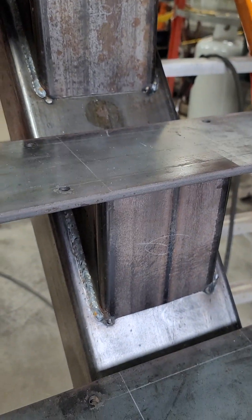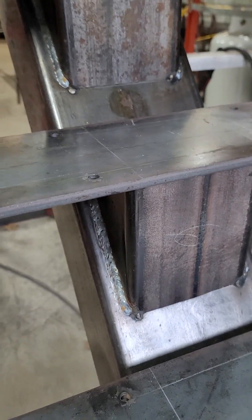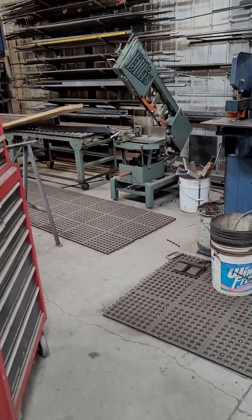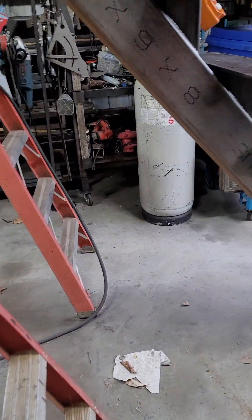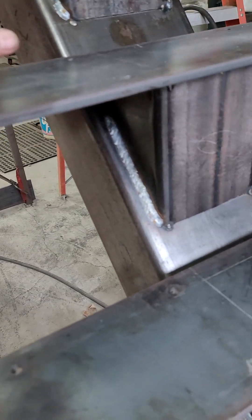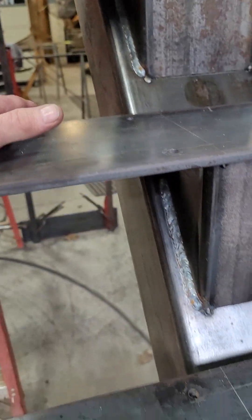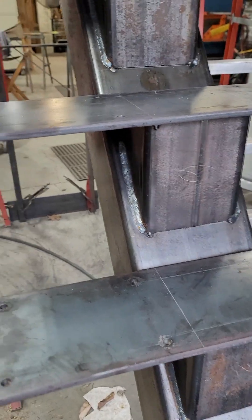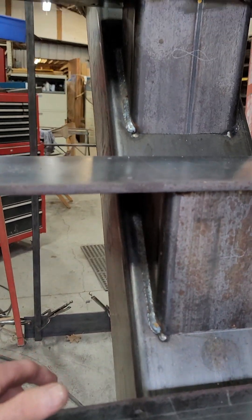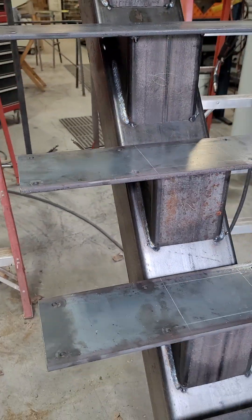That's just the nature of saw cuts. Even though I've got a good Ellis saw — I'm using an Ellis Model 1600, which is a great, tremendous saw — sometimes the cuts just aren't absolutely dead perfect. The beams can be a little concave and flex a little bit. But they're real close, and when you put them on there, you just have to tweak a little bit. Any tweaking is going to be covered and filled in with weld anyway.